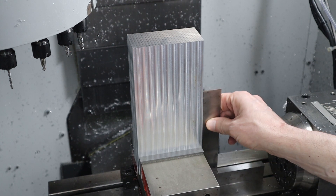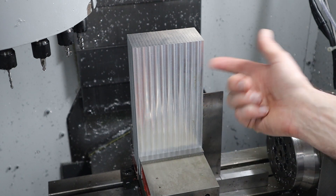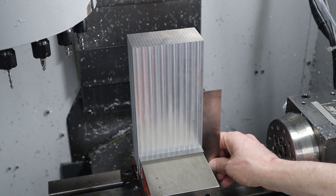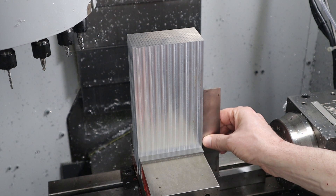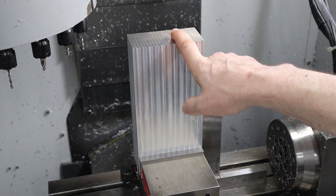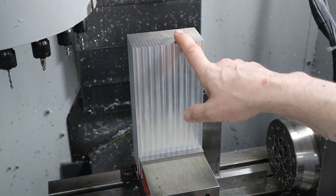The other thing I was doing was feeling the pivot point. I could feel the pivot point was up here, so I knew I needed to bump it over a little bit. And now it feels like it's scraping all the way along. That should be good enough. I'm going to clean this off by hand using the jog wheel back and forth.